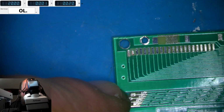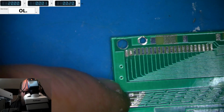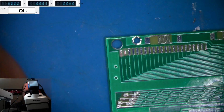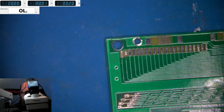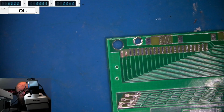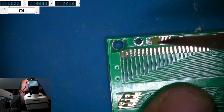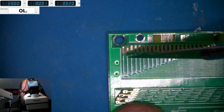And then I figured, while I was waiting, I have copper tape, I can use that. But then again, I can't find the copper tape, and no shops are open today, and I ain't gonna drive to get just the tape, so I will just make do, and I will jumper it, just create some new pads and cure it with UV mask.